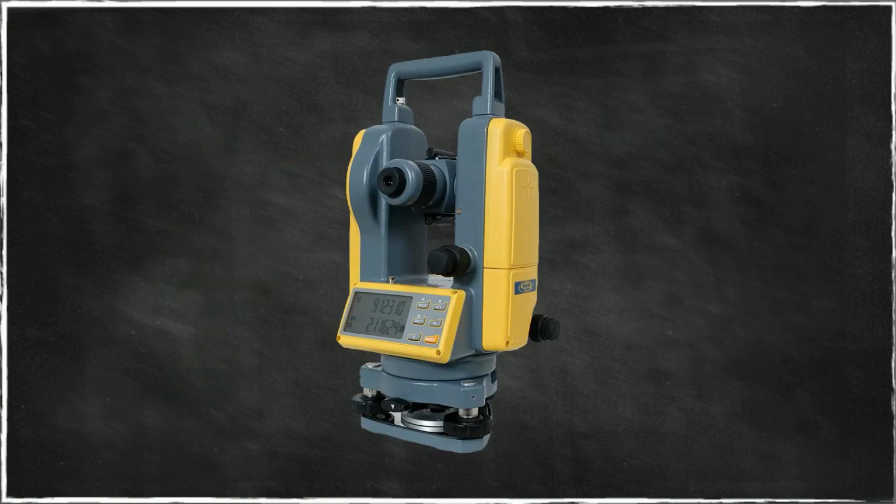Now, I mentioned the measurement of the height of instrument, and I mentioned that this telescope has a horizontal axis along which it turns vertically. The center of that axis is marked with a dot on the side of the box that holds the instrument. That dot is the one to be used for the measurement of the height of instrument. So the instrument is ready for use.